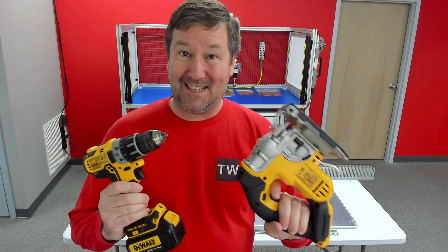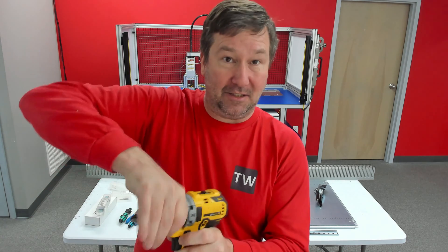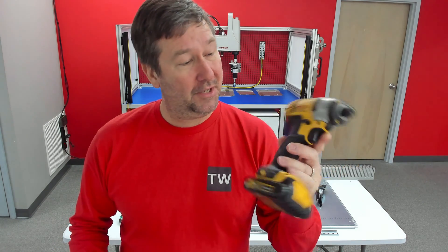As far as power tools, you will need at least a jigsaw and a basic drill — I would get a multi-speed one that has a good quality chuck and a little slip feature, so that when you bind on something, you don't break the screw — it stalls instead. Another really good tool, if you can pick one up, is this impact driver here. It'll save us a lot of time, especially when you're using the drill-tap combos.